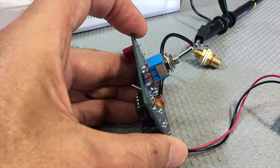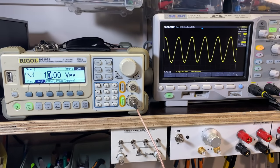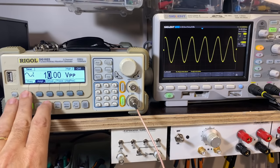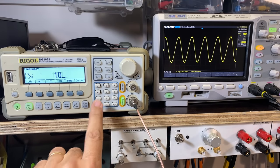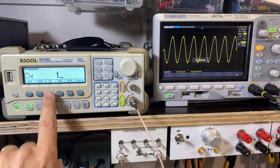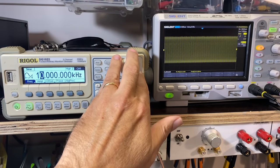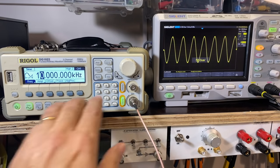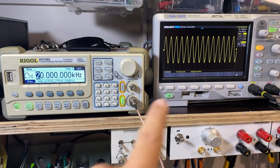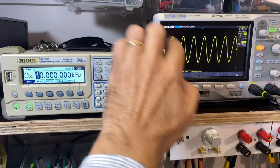Let's try on times 10 and see what happens. We'll increase the amplitude to 10 volts just to make it easier to read. We've got the same situation — 968 millivolts, which is one-tenth and a little bit less. Let's go up in frequency to 100 hertz — 1 volt, perfect. Let's go up to 1 kilohertz — 1 volt, perfect. 10 kilohertz — 992 millivolts, exactly the same. 20 kilohertz — 1 volt. So we've got a slight variation, jumping between 992 and 1 volt — that's with a direct probe.